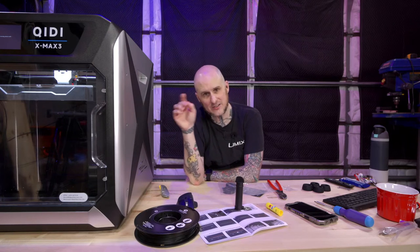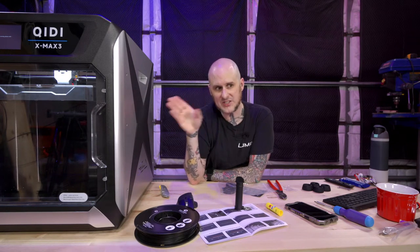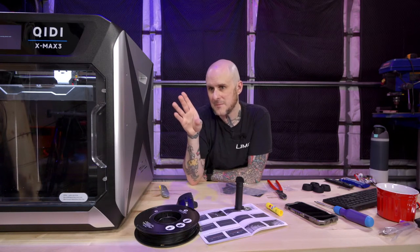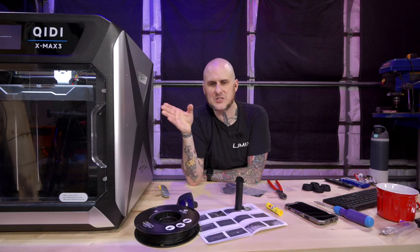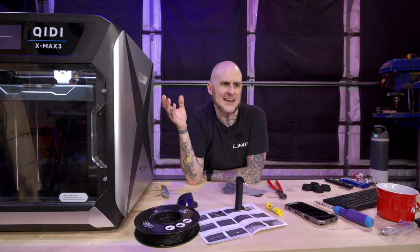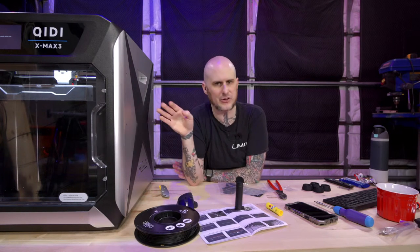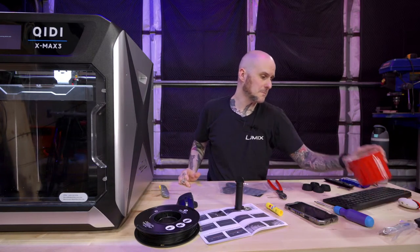On the materials I was working with, you can read the log of what the machine is doing when it's doing the scans, if you look at it the right way. I was able to go through the log and find that it was laying down different pressure advance values to test it. And every single time it just defaulted to the default setting. It never took any information from the tuning. It just didn't.